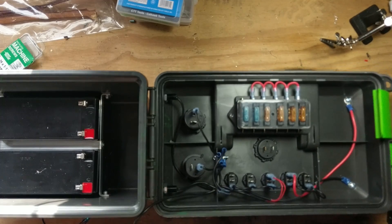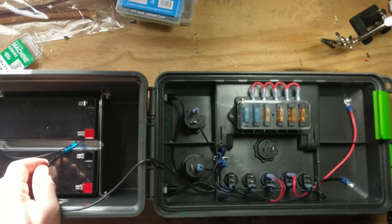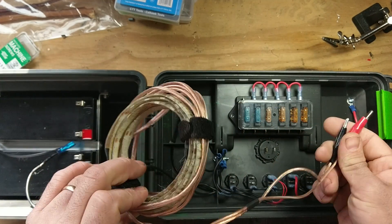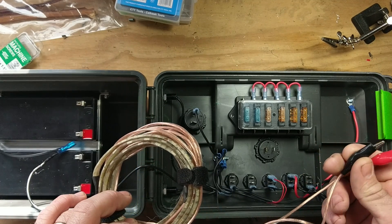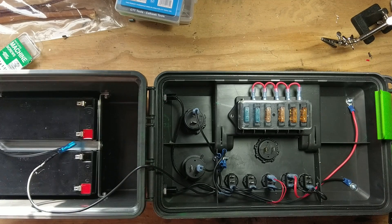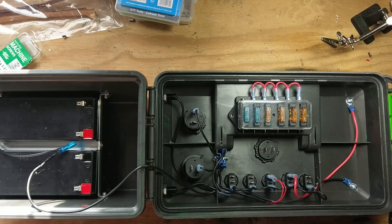On this side I've got the negative running to a central location — there's a little bolt right here that all the negative terminals run to, so that keeps it a little bit cleaner. All the negative posts on the switches are hooked together, and also the negative post on my little power points on the outside. Those are good for running LED light strips or little jumper cables to other 12 volt batteries. I also have a video on my channel on how to make these little LED 12 volt light strips. Then we've got the positive running over to the second switch, which is going to be our master switch.